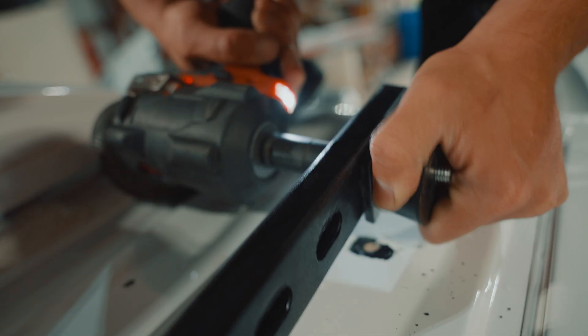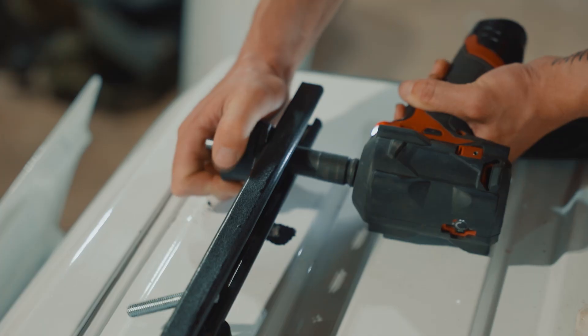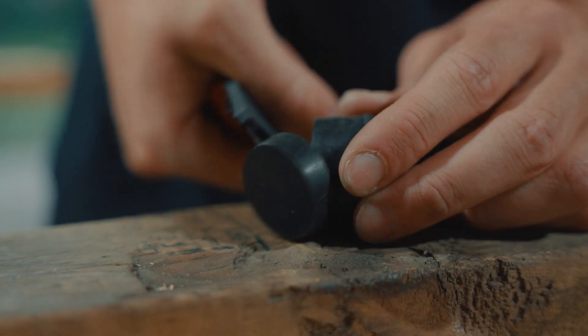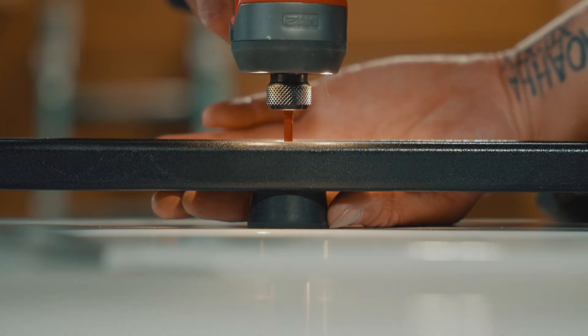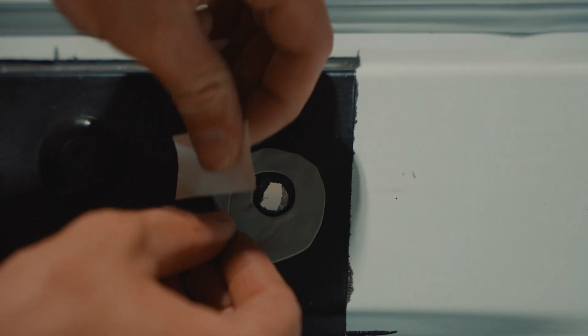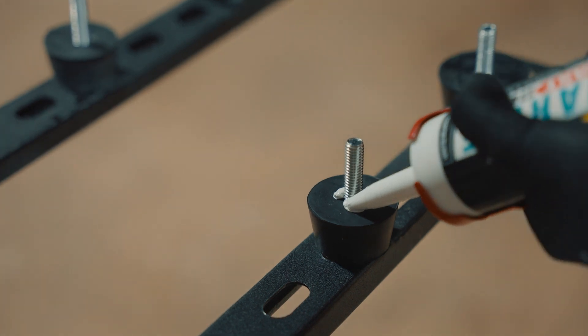We got everything preset and tried our best to line everything up with the holes. We also had to cut some of the stoppers so the rails would sit more even, and we added an extra stopper in the middle just for some added support. There's always going to be little quirks and challenges that you have to face along the way — it's basically just problem solving and patience. We put some butyl tape down around the edges of the holes and added some marine adhesive sealant to the inner parts of the stoppers.